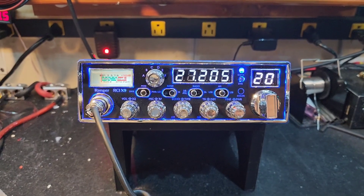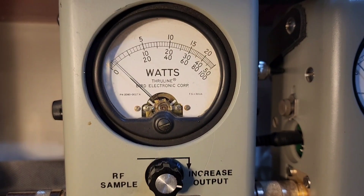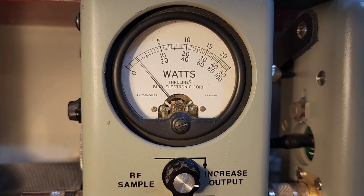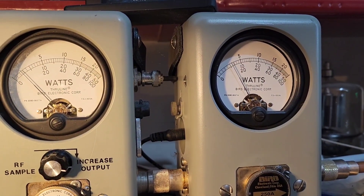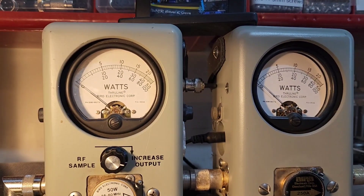I haven't touched any of the knobs or anything. I'll make sure the RF power is all the way down. Got the 50-watt slug right here. Keying it is like a watt and a half — just about 3 watts. On the 250-watt scale, going into 25-watt PEP.